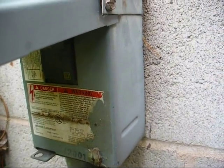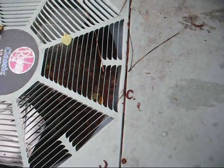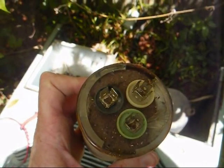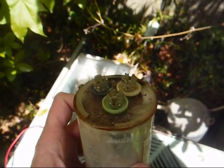The first thing we want to do is turn the breaker off, which we've already done. Then we'll remove the screws that hold the access panel on — these are not the original screws. Some dimwit worked on this one time and didn't put the screws back in, so I had to go round up some TV back screws to hold it in place. You simply disconnect the wires from the terminals, making note of what wire goes where, remove two screws, and the capacitor just lifts out.